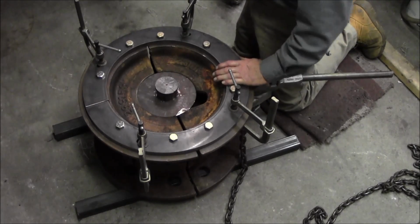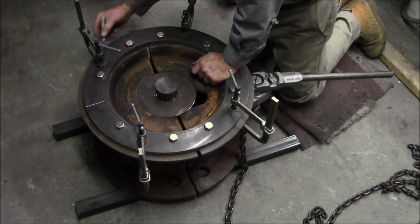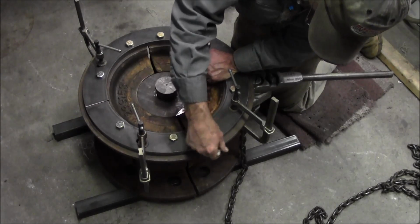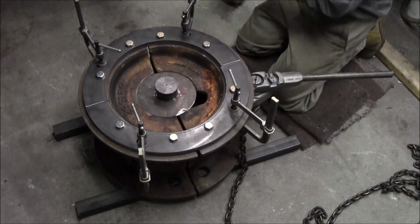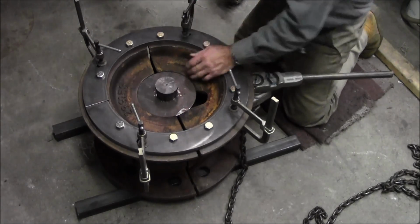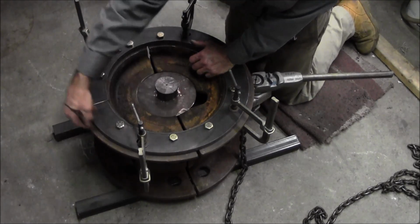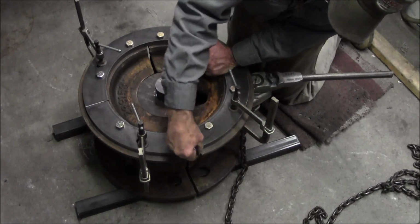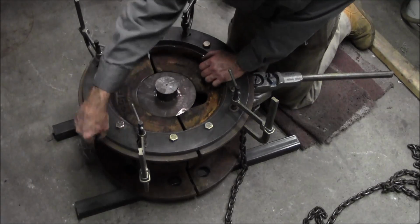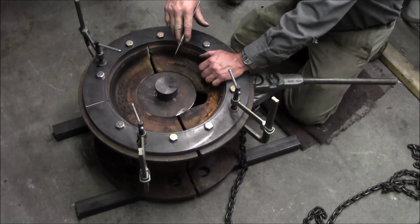Okay, now we can go ahead and take a Sharpie. This is general, but on this metal, unless it's aluminum, it's real hard to see that Sharpie. But with your helmet up or your glasses off, and good light, you can see that. It also makes a good background for a scribe line. Now, you can always see a scribe line, and the scribe line doesn't go away with heat. In fact, sometimes you actually get to see it a little bit better. But having that little Sharpie behind it, almost like laying down the dykem. You're laying out a scribe line to plasma cut.